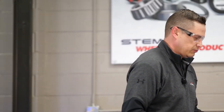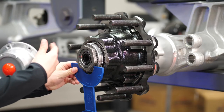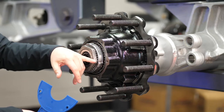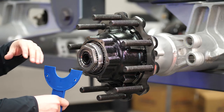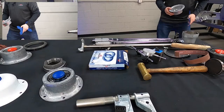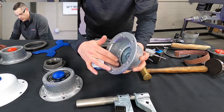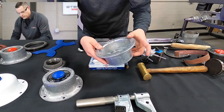For a system using semi-fluid grease rather than oil, you'd use a solid cap. There's a template you can butt up against the hub prior to putting the outer bearing in to contain the grease. With semi-fluid grease, fill half the hub cavity — from three to nine o'clock — with semi-fluid grease. Once you've reached the correct level, take off the template, slide the outer bearing in quickly, and begin your torque procedure. With the semi-fluid cap, put a small amount in the bottom — making sure not to cover the vent — to protect against corrosion, and so the outer bearing and axle fastener get a little lubrication.